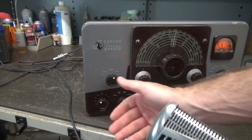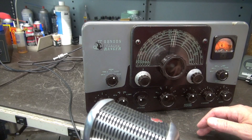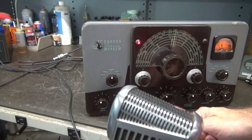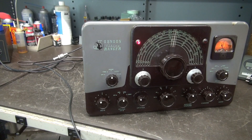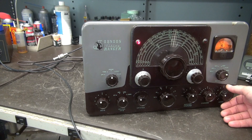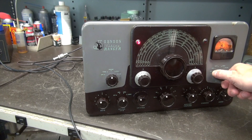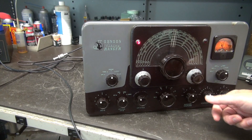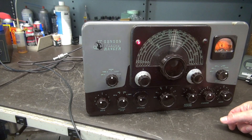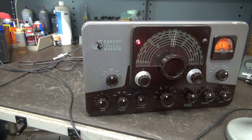Push-to-talk is installed. So you can go to standby mode, show key, but there's no transmit. Go to phone — no snappity pops, right? And there we are, you can see the modulation over here swinging, we're transmitting. There's my plate current — dip it — working flawlessly. Another successful push-to-talk installation.